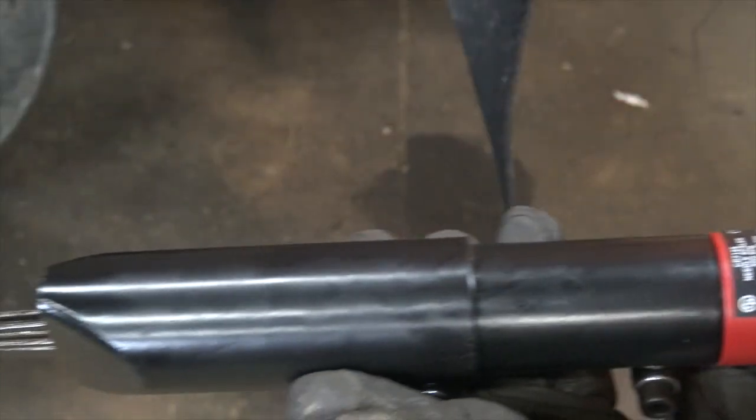The other cool thing about needle scalers: they're great for removing slag off of welds. If you're putting down massive amounts of welds, they're really good for that. They're also good for peening metal — to kind of massage the surface of, say, some cast iron that you've welded, to help relieve heat-induced stress upon that material.